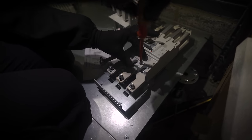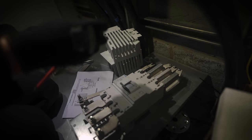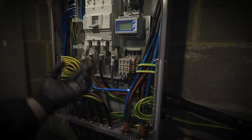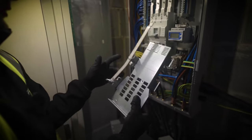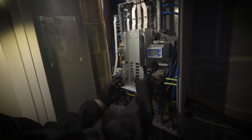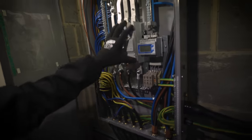If we undo these two screws we should be able to get it off the back plate. There we go. So this plate is substantially smaller than this one - it's designed to pick up and house the meter, fuses and that sort of stuff, so this is no good. The neutral bar doesn't need changing - that's sweet. I'm happy with that, it's exactly the same size. So we're not worried about that at all.